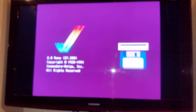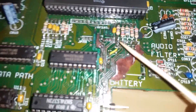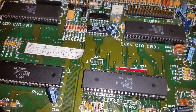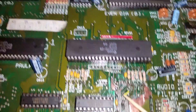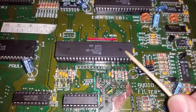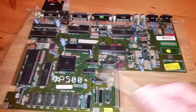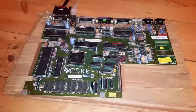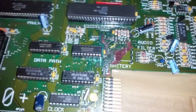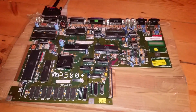It's a short video, but if you get a blue screen, then black, and then no signal - it's well worth checking that trace. It goes up to R113, down through the board, and ends up on pin 1 of U12 and pin 4 on Gary, going through R113. So just watch out for that. This is going to be part of a proper video on how I did all this, but I just thought that got me for ages - worth knowing. See you all soon, bye!